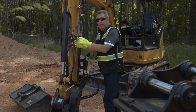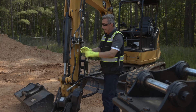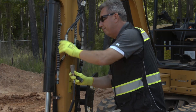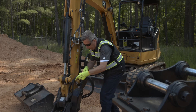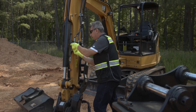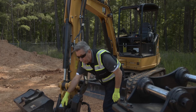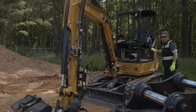This is a safety device — this is so we don't drop everything off and rip our hose and our electrics. So what I'm going to do now is swap my coupler electrics over. We won't need that one — we'll make sure that's not going to be in the way when we release it, make sure that's not in the dirt, and we will put our dummy plug over onto the other side. Now the machine will be looking at the dual lock coupler on the top, and we will go ahead and take our TRS4 off.